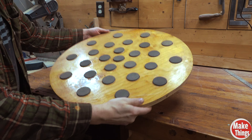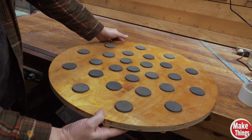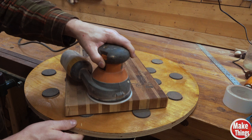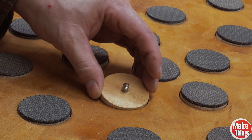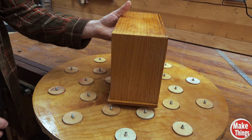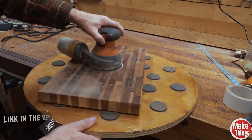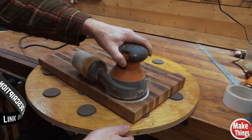The second option is to make a dog hole finish board that has a pipe fitting any three-quarter inch hole on your bench. It has grippy pads made from carpet runner that allow you to easily sand your project. Flip the pads over and you have set screw points that hold your project above the surface so you can spin to see every angle, finish one side, and flip the project to do the other. This is my favorite way to work with cutting boards, and I have full step-by-step plans if you're interested.